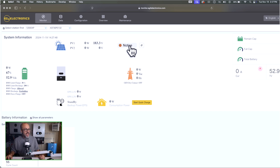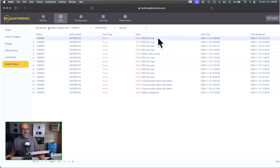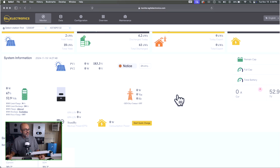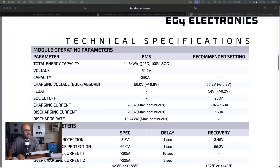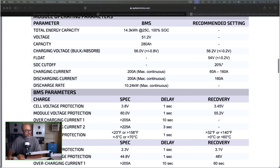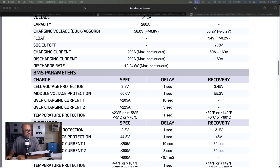We got a notice — clicking on it, it says EPS overload, probably because we're overloading the amps on the battery. The battery kicked back on but the inverter output is still not on. Looking at the specs for the indoor Power Pro wall battery — 280 amp hours — the max continuous discharge current is 200 amps, with a recommended of 160 amps. When it's less than 205 amps it can sustain for 10 seconds; less than 225 amps it can do 3 seconds. We were at 207 amps and still going up, which is why it kicked out. It had nothing to do with the inverter — it was just the battery, because you need that 400 amp hours.